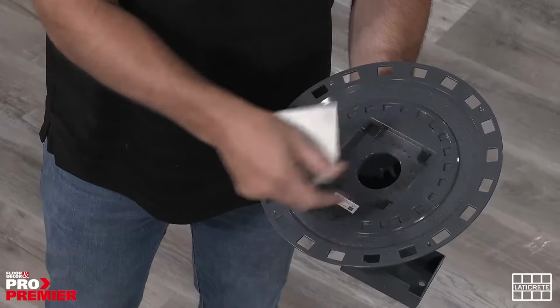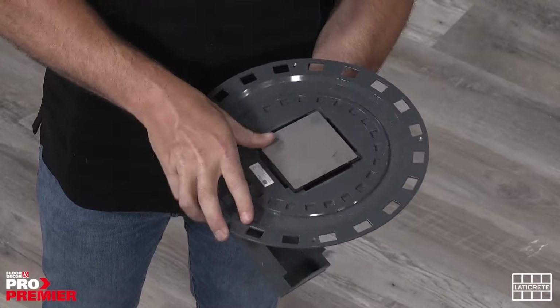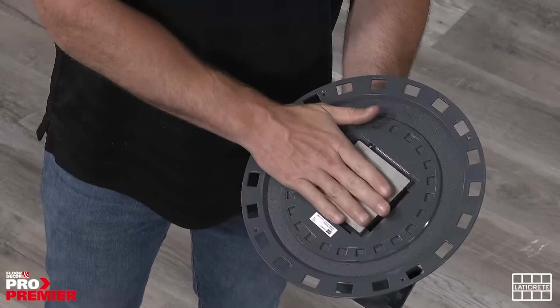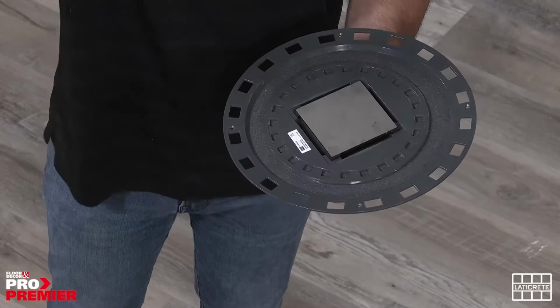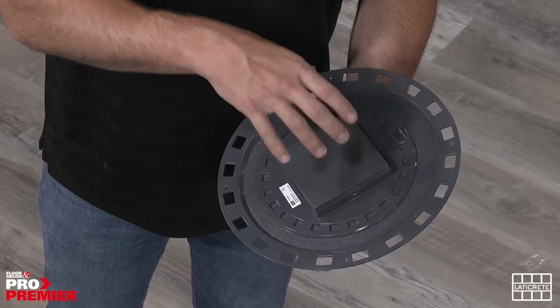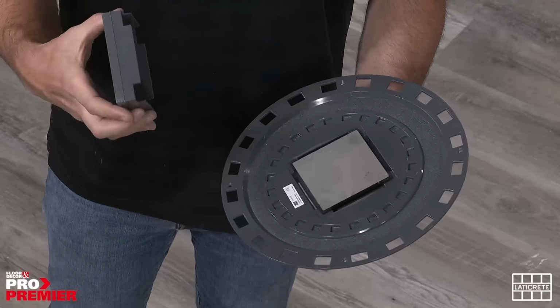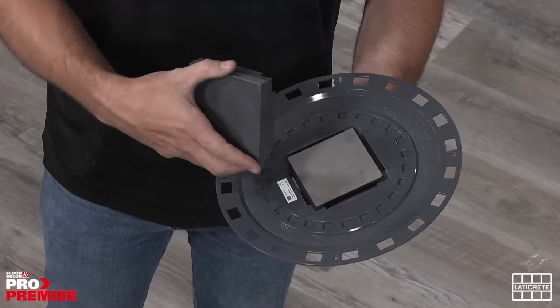They have 4 silicone feet that you sit the finishing plate on top of. It fits in nice and snug, makes a nice snap so you know that you're there. You're going to adhere and apply that final tile. But before doing so and during the installation, you have the protection cap over the top, which is going to stop mortar or extra thin set from getting in and gunking up the waste outlet. And then when you peel it away, a nice crisp finish around all 4 edges of that final tile.